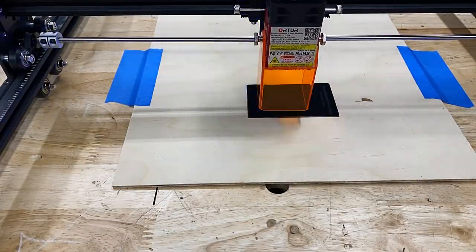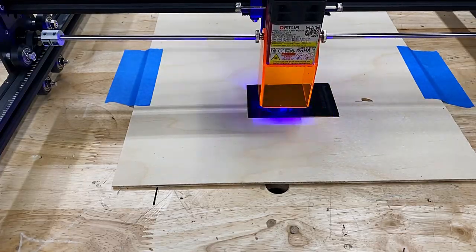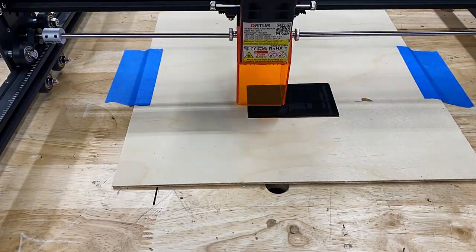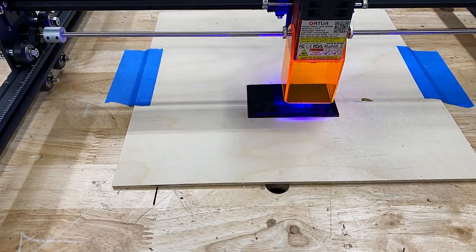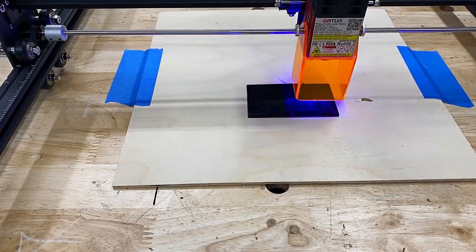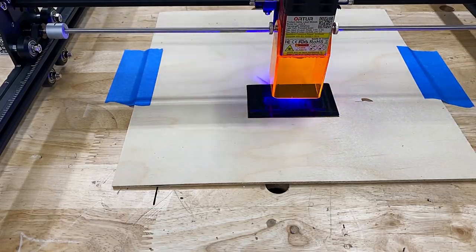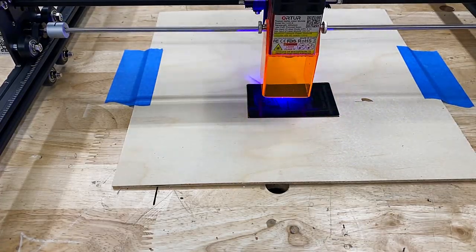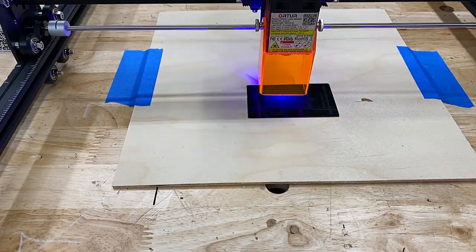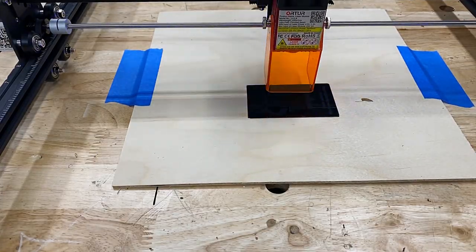This is sped up 10 times the actual speed for the aluminum card. I believe they're anodized but I'm not certain — I know on my 60-watt laser it removes the coating entirely and you can see shiny aluminum underneath. This one didn't seem to be doing that at only 5.5 watts. The total time for this was about 25 minutes, so you're not going to want to do many of these. It's a solid rastered image, and in LightBurn there are different dithering options like Stucki or Jarvis.